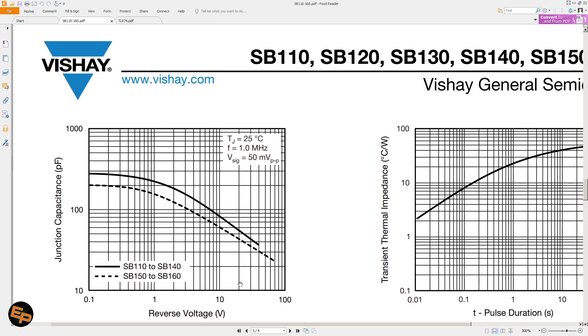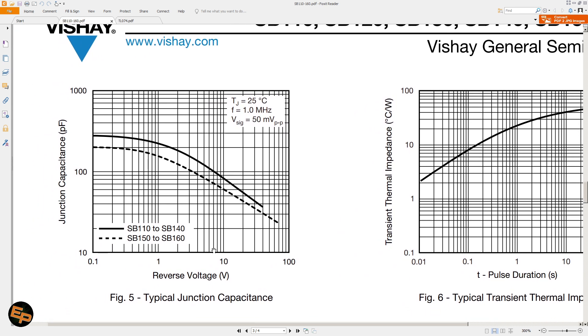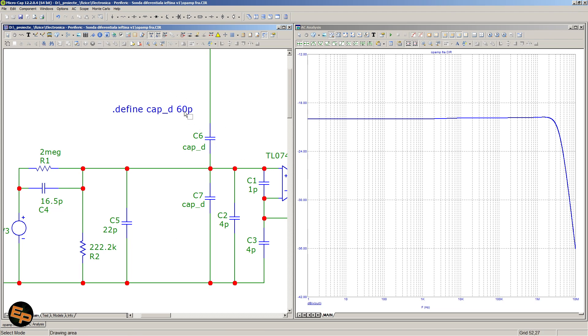With this circuit powered, we need to inject a voltage into the input relative to the ground — and we need to do this twice, once for each of the input pins. I will explain only for the positive side, but you need to do the exact same thing for the negative side. Take a constant, well-known voltage source and apply it to one of the input pins relative to the ground. I used a 10 volt power supply for simplicity, and used the most precise multimeter in my lab. If we apply 10 volts on one input, we need to adjust R23 to the point where this node has only 1 volt — since this needs to be a 1-to-10 divider.